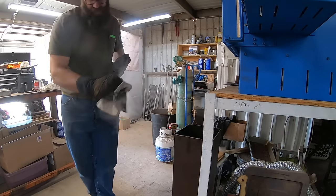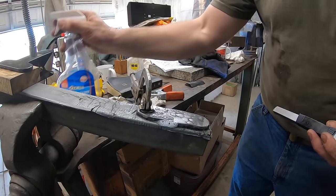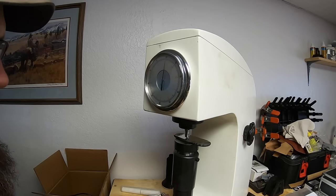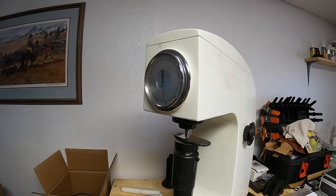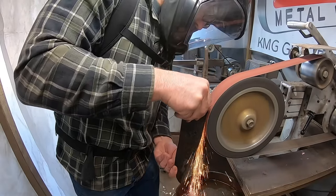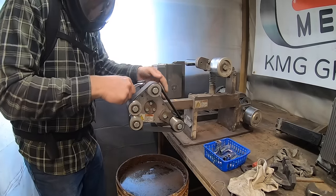I tested the coupon right out of the quench after it cooled to ambient temperature and got a fairly low reading of about 61 Rockwell hardness. The reason for that is I use a form of marquenching on my blades, which means there's already an amount of tempering that has happened before you put it in for the tempering cycles. Cooling it down to ambient temperature very quickly in the quench is a great way to crack blades. At the end of the entire heat treating regimen, the coupon was at 58 Rockwell hardness, which I think is an acceptable hardness for a big tough chopper like this.